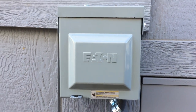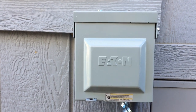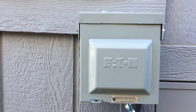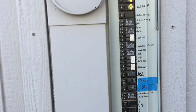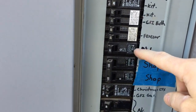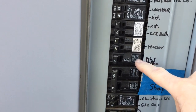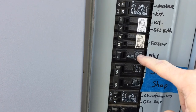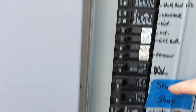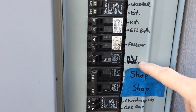All of the materials I used came to probably fifty to sixty dollars, including the 30 amp breaker installed in my home panel. I've got the box open here, and this was the slot I used. It was two separate breakers and I ended up swapping in one 30 amp breaker instead — it was two 15s — and I put in the 30 amp breaker and just marked it 'RV' so I know which one is which.